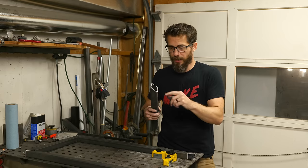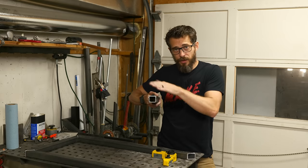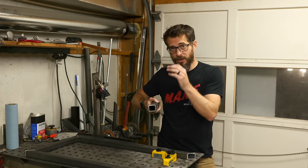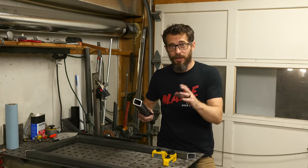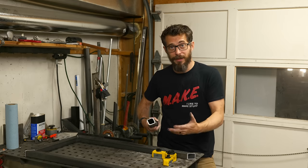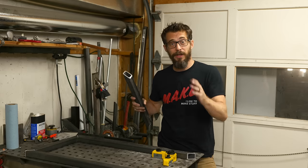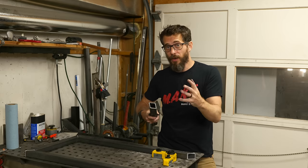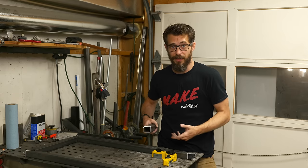To get these ready to weld together I added a small chamfer around all of the pieces on the grinder — that gives you a little place for the welding material to go and you end up with a better looking and stronger weld. A lot of times people give me a hard time about how ugly my welding is, and honestly I'm not a professional, I'm just figuring it out as I go. But I do want to encourage you: you don't have to know how to do something to give it a shot, and it's okay to have slow progress as long as you're working towards getting a little bit better every time.